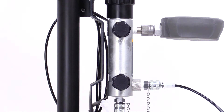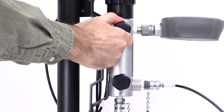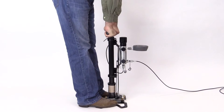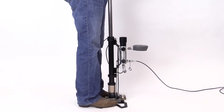Make sure the inlet valve on the calibration manifold is open and the two vent valves are closed. Pump the 700 HPPK to generate pressure. Generally, you can generate 21 megapascal, or 3000 PSI, within 20 seconds if you pump with full strokes.